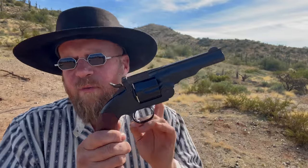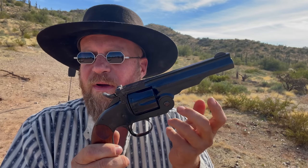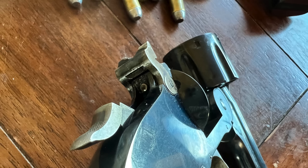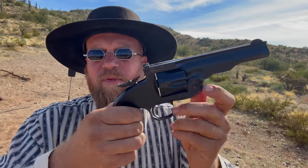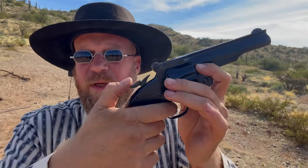The Performance Center reissue I have from Smith & Wesson is chambered in .45 Schofield — they did that part right. However, it has a transfer bar safety and frame-mounted firing pin, things that were not historically accurate, probably because of the lawyers. When I got this Uberti, I was very happy to see it has a proper firing pin. It doesn't have any safety that wasn't historically there, so as a result this performs and functions like the original.